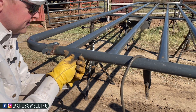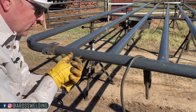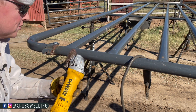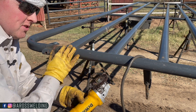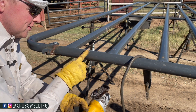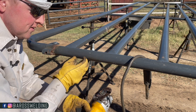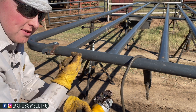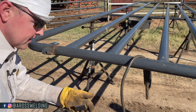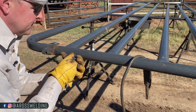The first thing I'm going to do is weld this piece of quarter inch plate onto this gate. Tip number one: take a wire brush or sanding pad on the thinner material. I like to use a wire brush because this material is so thin — if you use a sanding pad you risk taking off more than just the paint and getting into already very thin material. Use a wire brush to brush off the paint, and that's going to help you put a good weld on.